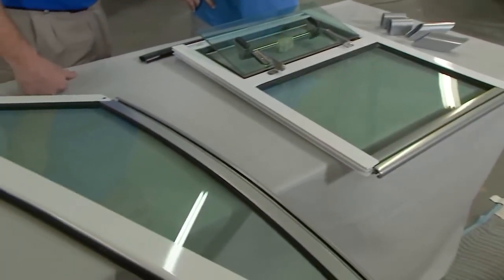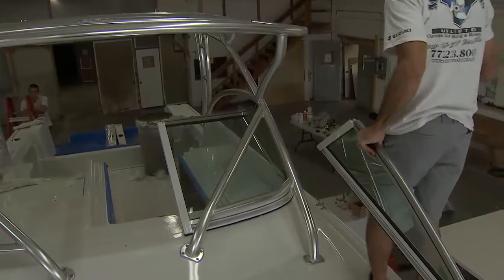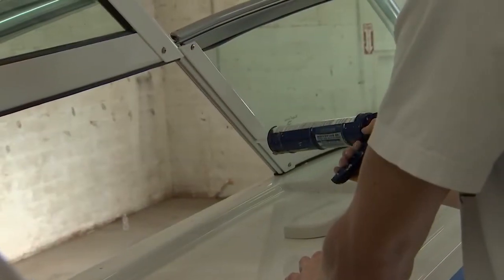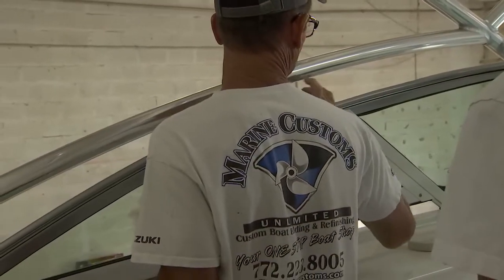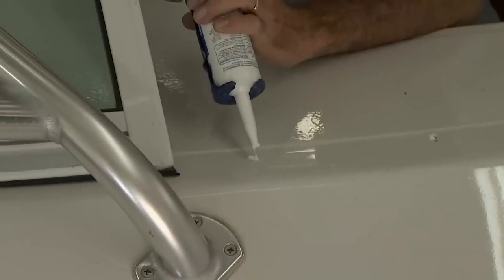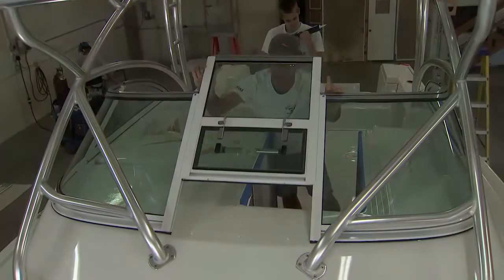Let's talk about the five pieces here. If somebody's going to be reinstalling a windshield or installing a new modernized windshield, how can we help them? First thing you want to do is tape off the area you're getting ready to install the windshield — that protects the gel coat. These are five-piece sections, so you'll want some support and help. Take a couple sections up at a time, put some sealant and silicone in each of the male-female joints, and when you're drilling through your fiberglass you definitely want to put silicone in each of those holes. What do you put underneath the windshield frame? We put a waterproof foam — called dog bone foam internally — and that helps take any variation between the frame and the fiberglass itself.